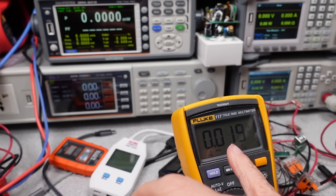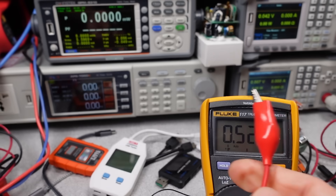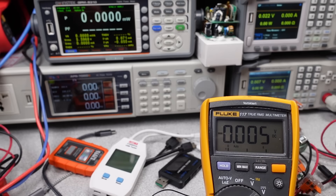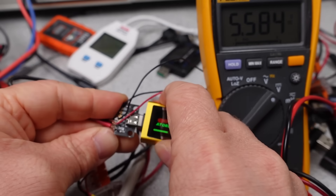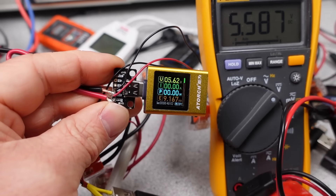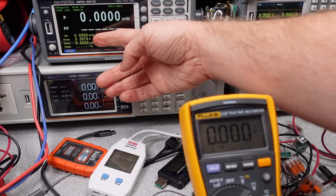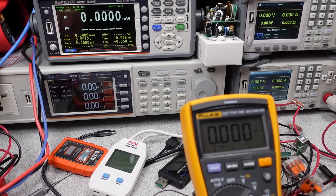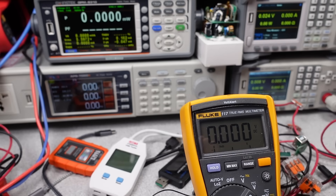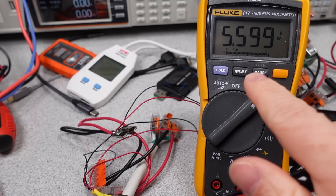There are a few basic measurements that need to be done to accomplish this. First, voltage. I'm not going to do a physics deep dive, but voltage is the potential between the two wires carrying current, which then becomes the power that gets to your device. These devices often use a divider circuit and an analog-to-digital converter to directly measure the voltage. The input of these circuits is often high resistance, so it shouldn't affect the measurement. This is the easier thing to measure, and how well this can measure voltage is half of the equation.